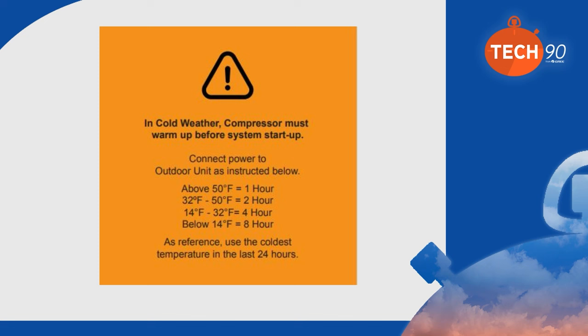I got it. Basically, what we've found is guys are not necessarily warming that compressor when they're installing it in cold climate applications. As you can see from the sticker, if it's above 50 degrees, we just want power applied to that unit for an hour. Then you can start that machine up. If it's 32 to 50 degrees, 2 hours; 14 to 32 degrees, 4 hours; below 14 degrees, we really need an 8 hour warm up or as close to it as possible.